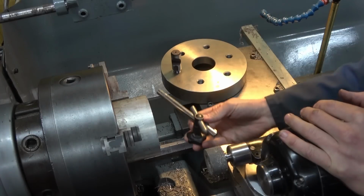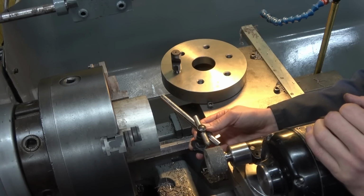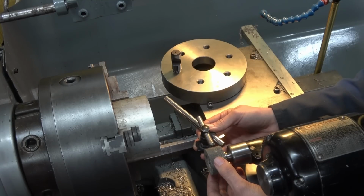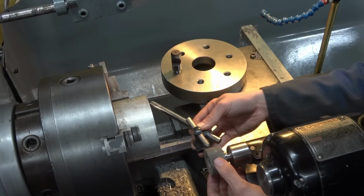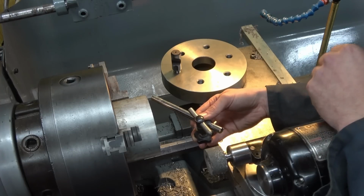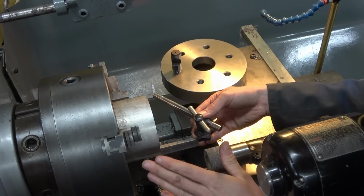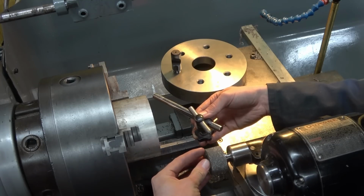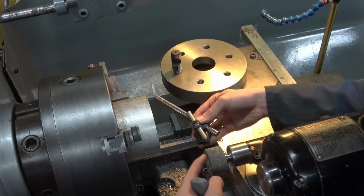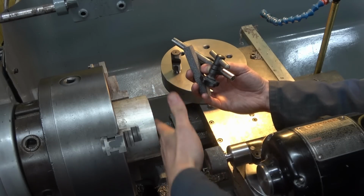Well, dressing the wheel will true the periphery to the machine's axes. So when I run up and down here, fine, it'll true the wheel and get it square with that axis of the machine. When I run up and down here, yeah, the angle will go on true and it will be parallel with the axes. But what it will not correct is the angle that the face is presented at. When I true the wheel with the dressing stick, I'm going to get a periphery that describes a flat surface, and that flat surface needs to be parallel with this.